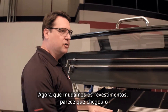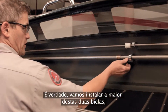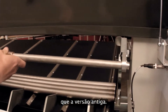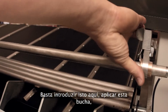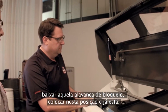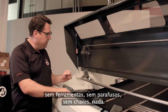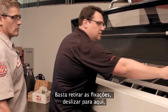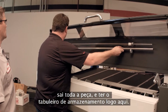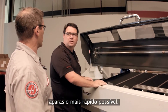Now that we've changed the liners over, it looks like it's time to install one of the push rods. That's right. We're going to install the larger of these two push rods. What's really nice about these is that they're just a lot easier to put into place than the old version. I just insert this here, pop the push rod into place, pull down that locking lever, and push it into place — and you're done. One of the things I really like about this: no tools, no screws, no wrenches, nothing. Just a ball detent holds that in place. Slide over here, out the whole piece comes. And having the storage tray right up here — fast, easy, quick. Get that machine back making chips as fast as we can.